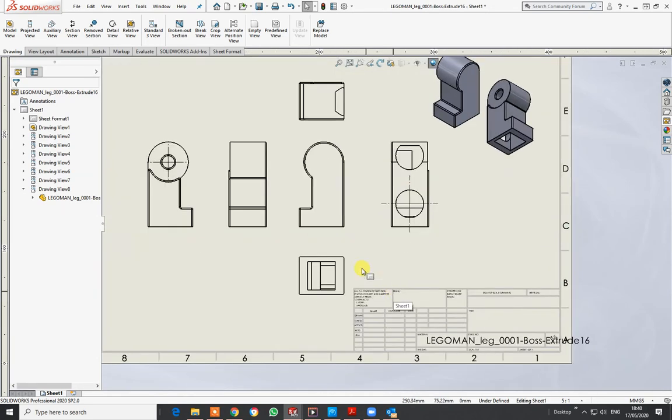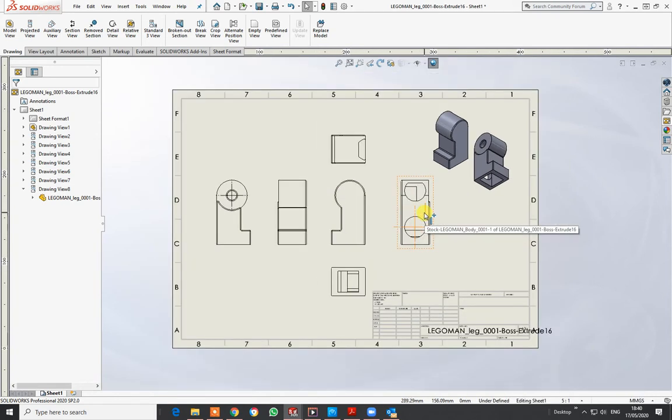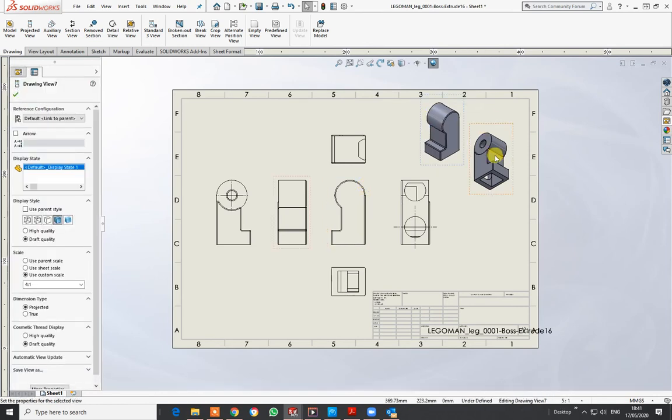With the drawing, it's as quick as that. I like to work off center lines, but you need datum points. I'm going to do some measurements — some overalls. Don't forget, it's a component drawing so I need to dimension just about everything. I can also do cutaways, so I'm going to move this view up before I start dimensioning.